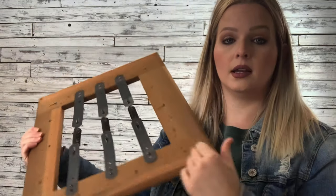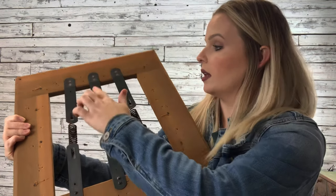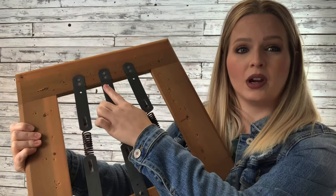But I thought, well, instead of reupholstering all these and replacing the springs, and then some of the older springs break, about a 50-50 chance, I am just going to find some webbing and do it that way. So I have a short clip of ripping these apart down to the bone, and they look like this after they're done. And these are springs. You can even see on some of these springs that are still here, they're starting to bend, and this is where they're breaking.